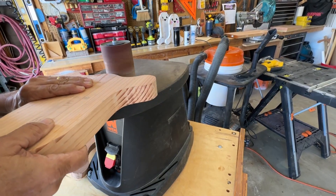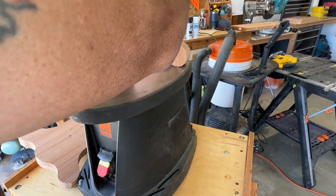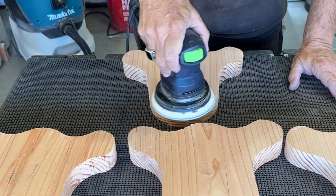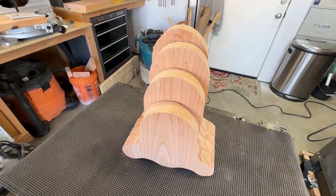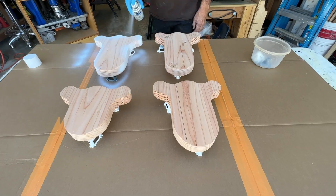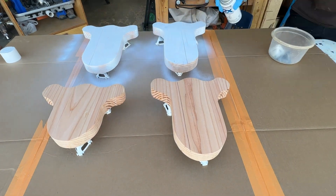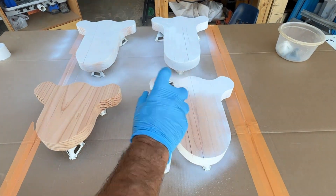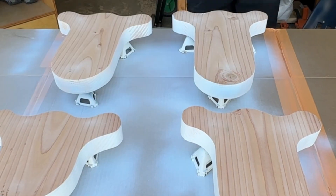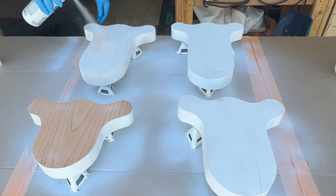All of the ghosts were high in the middle, so I just worked it down until it wasn't wobbling anymore and it was nice and steady. I sanded it one time with 100 grit and that was it. I'm using white flat paint, but you could use regular house paint or primer — primer works great. These little painter cones work really good. I always paint the back side first, flip it over, and then paint the front side. So if you have a little indentation on the back side, no biggie.